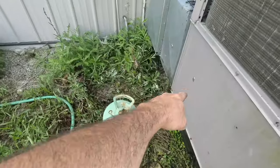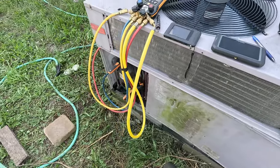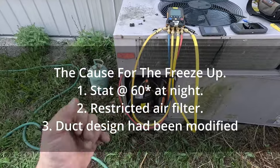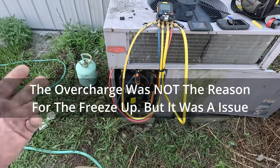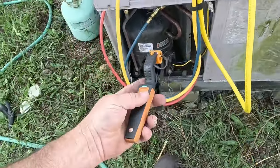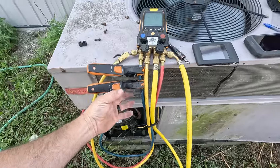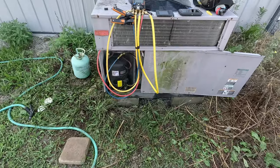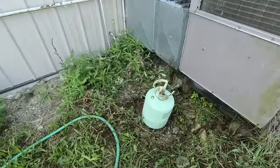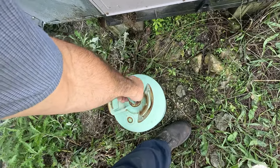We've got 13 degrees superheat, silicone is up, everything's put back together. I recommended that we add a fan cycle control to it. He said if it freezes up again, he'll do that. Alternatively, you can put a thermostat in the evaporator coil or on the suction line to shut it down if it gets too cold and freezes up — but it makes more sense to have the fan cycle control so it can cycle the fan, preventing freezing and keeping it running. They are doing things in there at moderate temperatures, so it would definitely benefit from it. That's not my gas — chances are somebody probably got it for him. You can tell by the line that it's about a third full — probably got about 8 pounds in there, and he should put it inside.